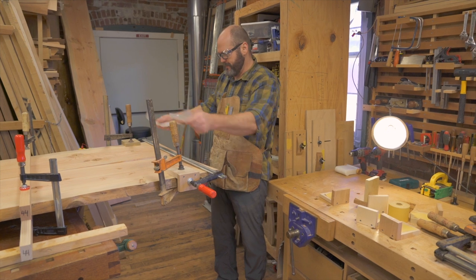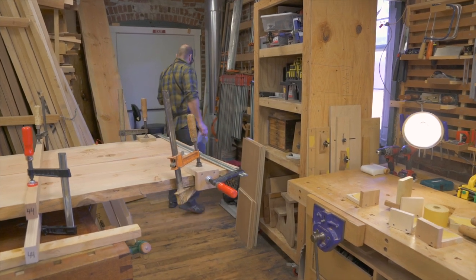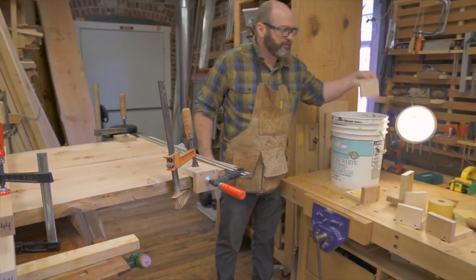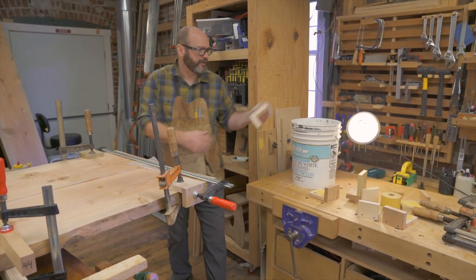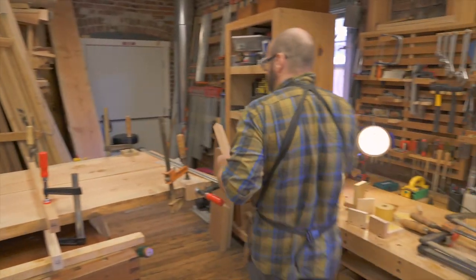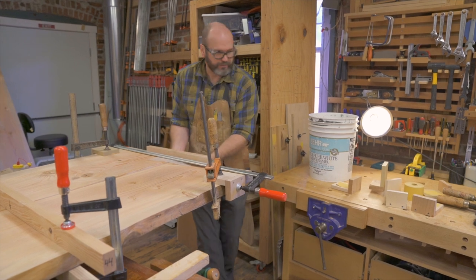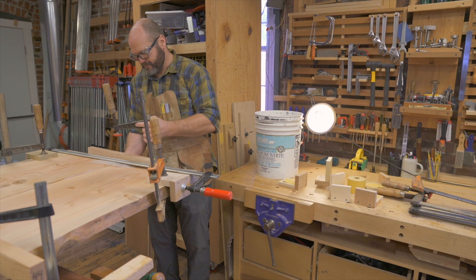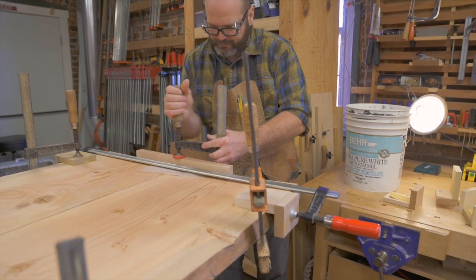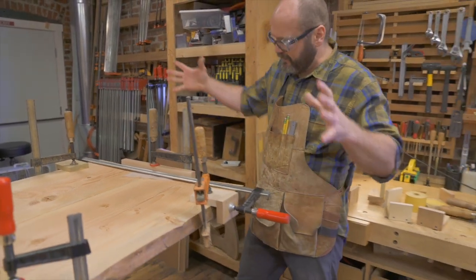What I'm going to do here is come vertically on it this way — I'll put a little wax paper there and grab a block. These have already been milled four square, so they'll help to suck the whole thing flat. I'll take one clamp and come right here. I don't go real tight with this — I just want to get them flatter. If I go real tight I can't close it up, so now I've sucked it tighter but it's still loose enough that I can pull the slabs together.